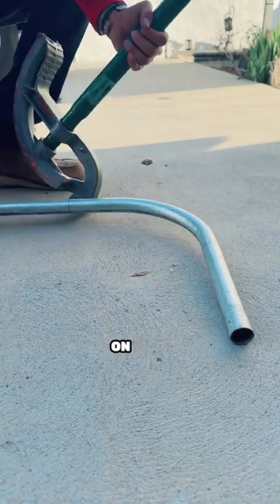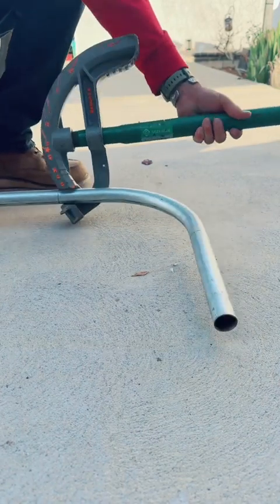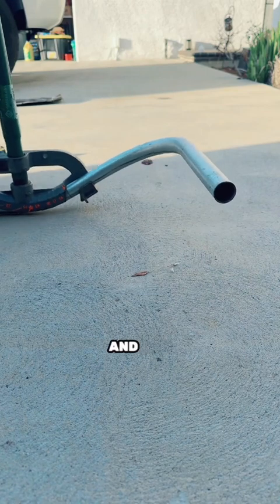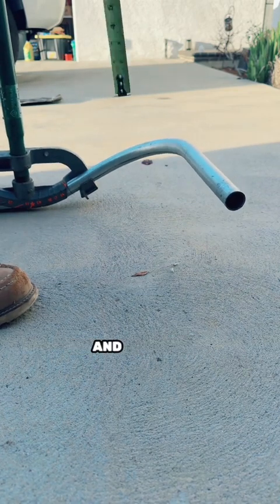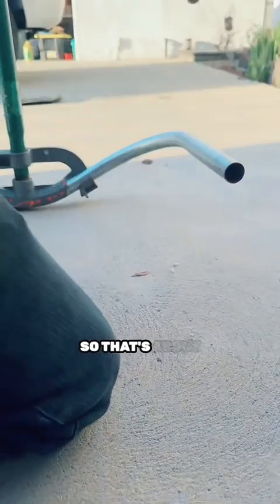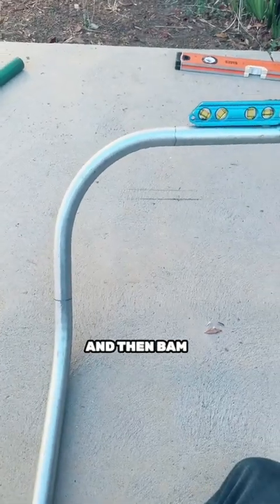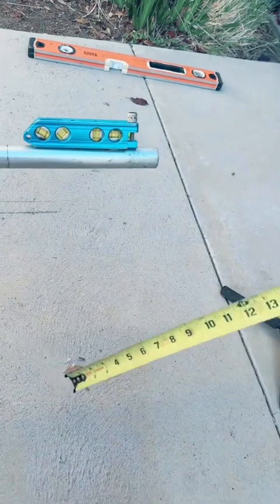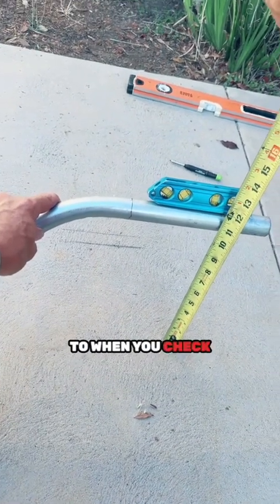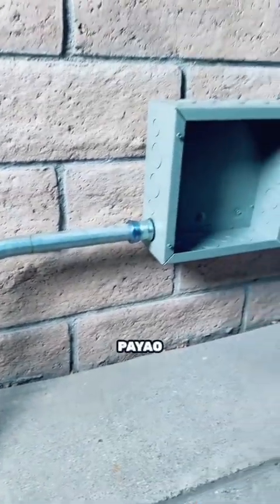You're going to have shrinkage on your kick — I want to do a separate video on that. Now I'm lining my second line up with the bend arrow and I bend it. We need 11 and a half inches, so I check it — about halfway there — then bend it some more. I've got the level on it. You need a level when you check it, and we're right there at 11 and a half inches.